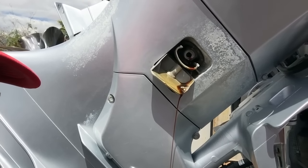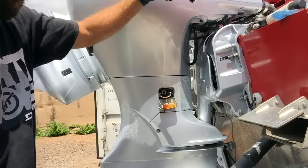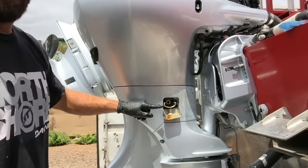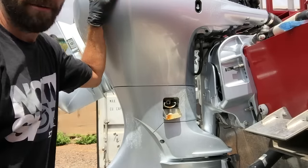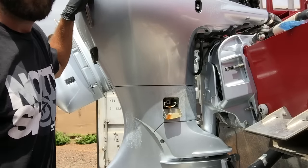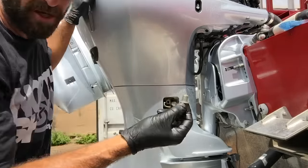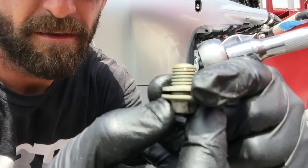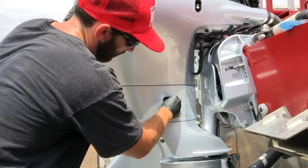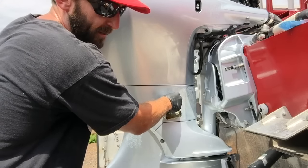Once that's done I'm going to put it back down and let the rest drain out. In Hawaii it's pretty warm and I just ran them, so I'm not going to let it drip too much more — it's just diminishing returns. If you're in a cold climate, people let it drip for over an hour. One thing to check: make sure you've got your little crush washer on there. They say to replace it every oil change, but I've never replaced it — it's been five years and 5,000 hours and we're still fine, no leakage.